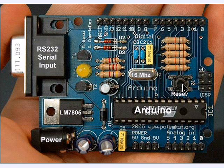There's the Arduino itself. And note down here, here's a power connector. This is for a plug-in-the-wall transformer, usually 7 to 12 volts. The regulator will change it to 5 volts, which is what the digital circuitry here will use. And the conversion circuitry for the RS232 serial input is these transistors and parts along here.